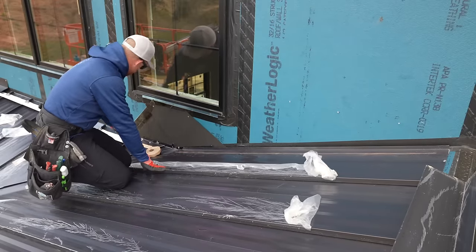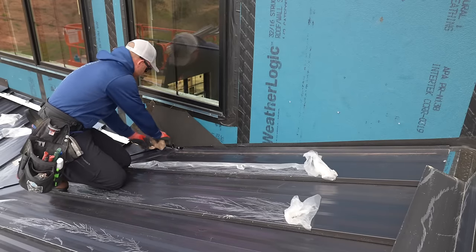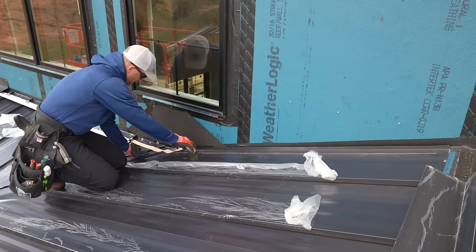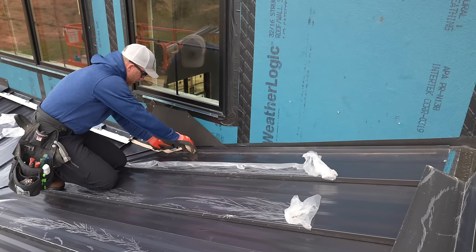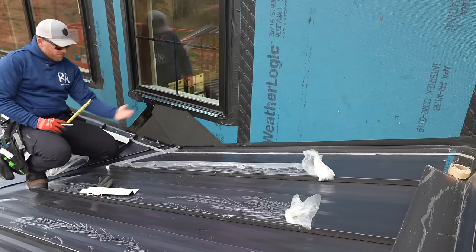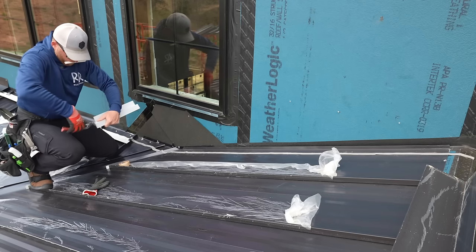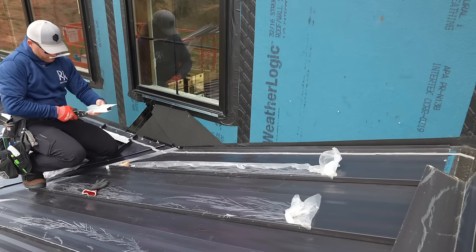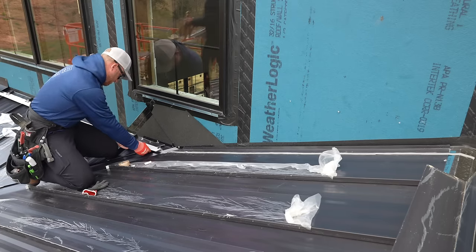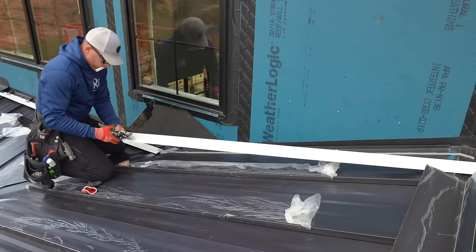This connection trim will run up over the valley, and then this one will come down and miter on the valley. We're going to continue to run the double beaded butyl tape right up and over, doing our best to get as tight as possible. Remember that up underneath here there is a potential for water to work its way back up, but this is all sealed off. I'm dealing with two different angles, so six-inch trim on this slope is not the same as six-inch trim flat — it's not going to be a perfect match. I've never done this before, so just kind of winging it.